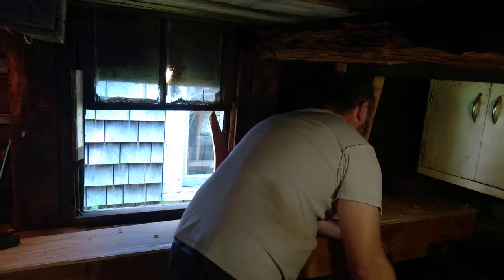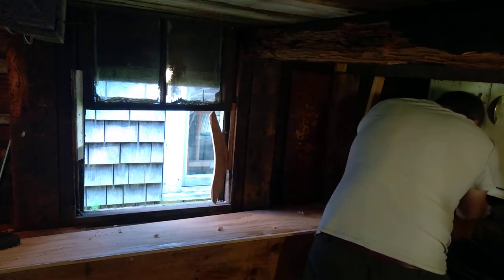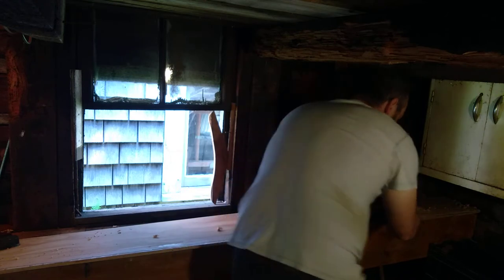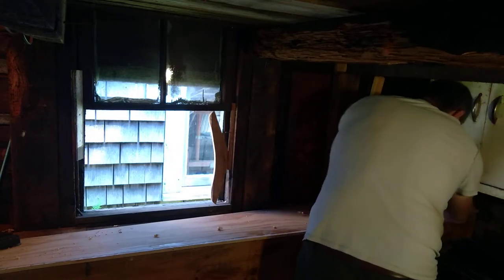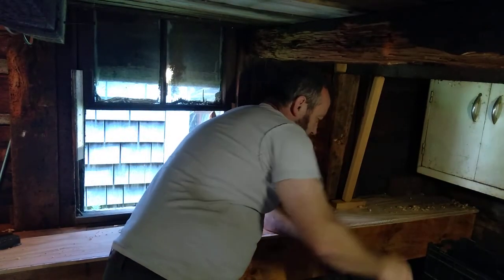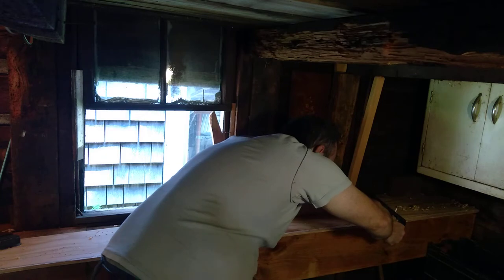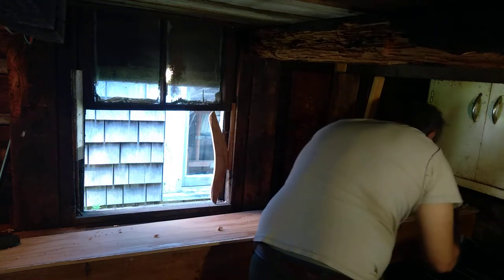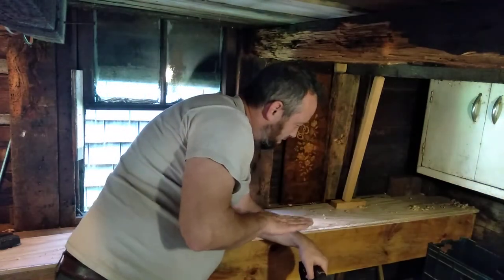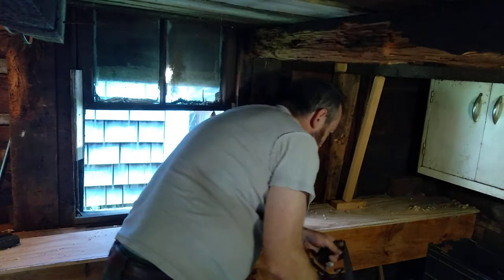Like I said, the most important part of cutting a nice tight rolling bevel is that the bevel doesn't roll in this direction when you put a plane on any one piece of the bevel. You want it to be a flat cut across wherever you're at. And what the bevel does is it's a flat plane that slowly rolls in that direction.